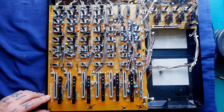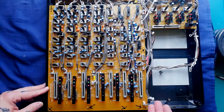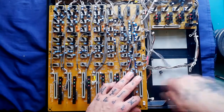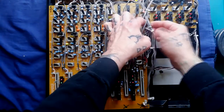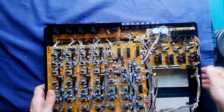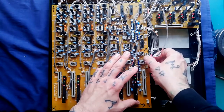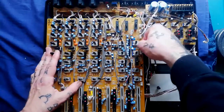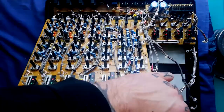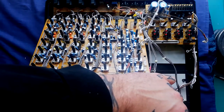Next, let's unplug this mixer amp volume PCB. We'll start in the bottom left corner and move our way around. This cable — they're tied together — is terminating on this one, either here or the board below. We'll confirm that as we go along. There's a group of three cables here. This plug, a brown cable, is coming underneath and running down towards the headphone sockets.